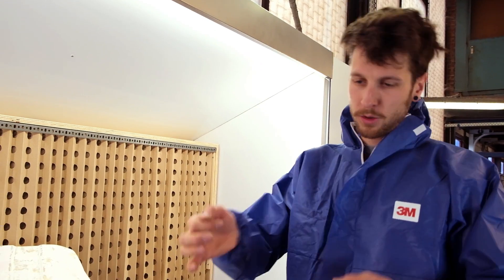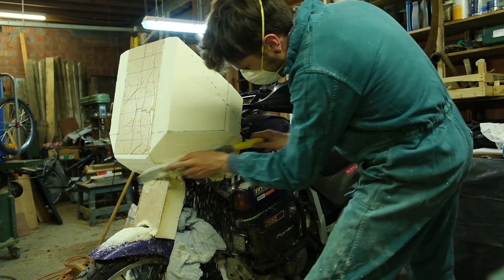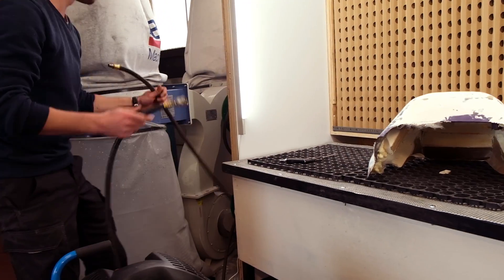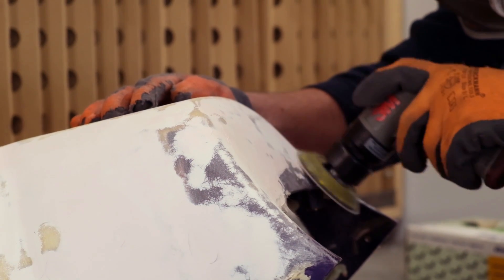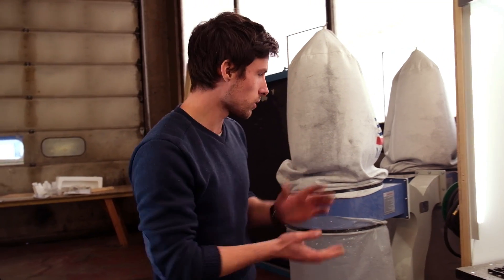You shape it by sanding, or you first cut off some pieces and sand it flush, then add the fiberglass. Sometimes you shape it by hand, sometimes with an iron saw to cut parts off, and then with woodworking tools — a really coarse file — you can shape the final form. I'm switching all my tools to compressed air because carbon fiber dust wrecked like six Dremels last year, and that was enough for me.